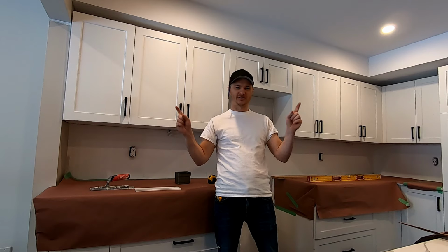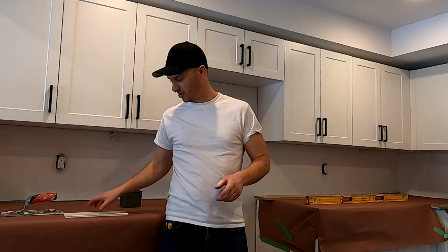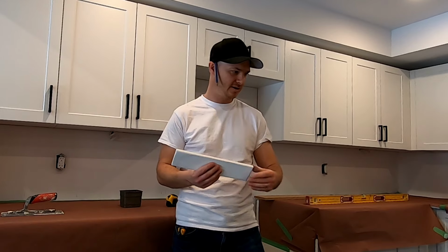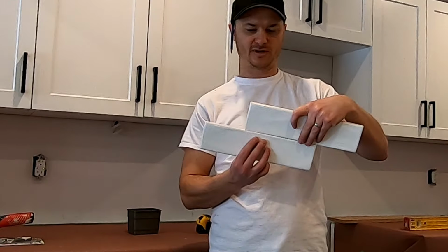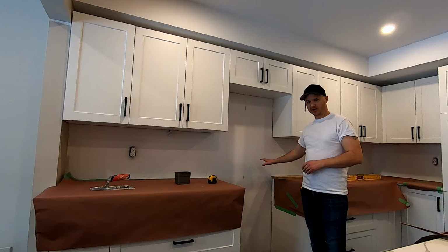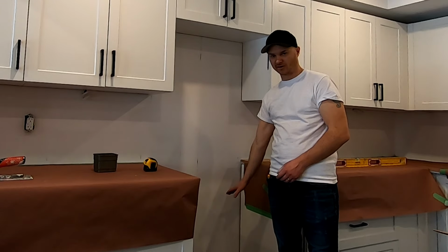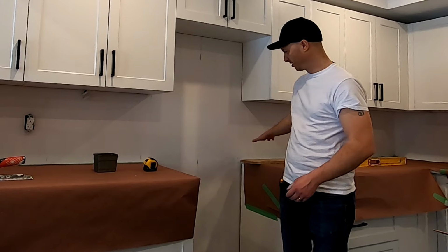Hello, I'm Brent, and in this video, I'm going to be installing backsplash tile. I'm going to be putting in this 3x12 subway tile, and I'm going to do a third stepped. When I'm doing my stove area, what I like to do is put a row of tile just down. I don't go all the way to the floor, just a row of tile down one below the countertops.